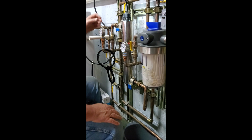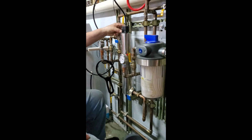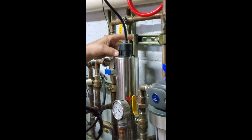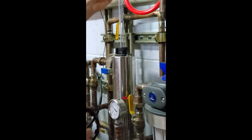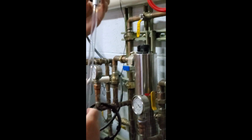All right, so now what we want to do is unplug this. So you squeeze. Can you see that? The size of that thing there? Take my fingers. You squeeze these two things, and you grab it and you just lift it straight up. Lift straight up and straight out. And there is your light bulb, the one you're taking out.